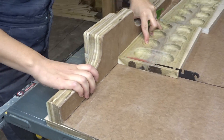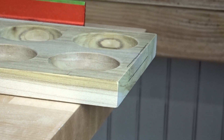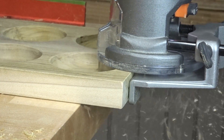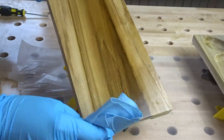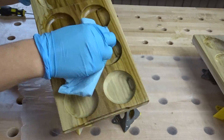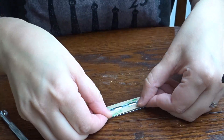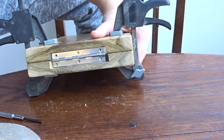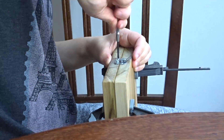Then I cut the board in half and trimmed it all to size. The final dimensions of the game are about 23 inches long and 6 and change wide. The final step was to route out the space for the piano hinge — I used the edge guide again on the router to create the space for the hinge, and it worked perfectly. I used two coats of wipe-on poly, sanding between each coat, and I just love how the poplar grain pops. Poplar is such a regular wood that people just paint over it, but every once in a while you'll find pieces with purples and greens, and I love to stock up on those. The last step was to put on the hinge — I used double-sided tape to hold it in place while I pre-drilled the holes, clamped the two boards together so they stayed perfectly even, then pre-drilled and put the screws in. I used the existing hardware from the old warped game board, put the latch on, and it is done.